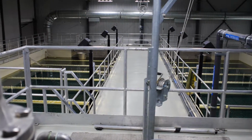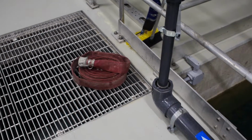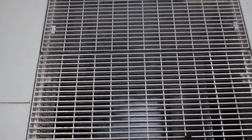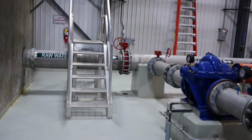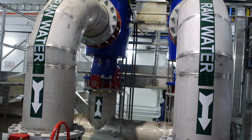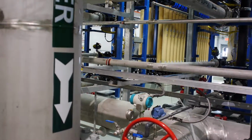the turbidity. Our water is then collected into an effluent tank that decides how hard the pumps at the river have to work. From the effluent tank, the water is then pumped through two strainers. The strainers will take out any larger pieces of debris, silt, sand that make it through the clarifier. The water is then pumped into the membranes.